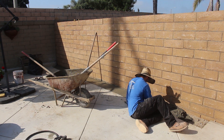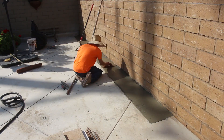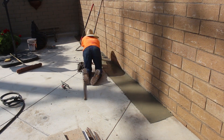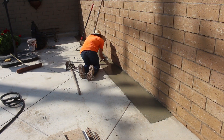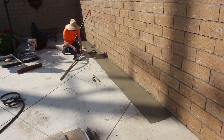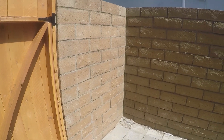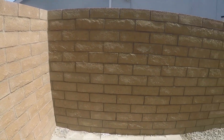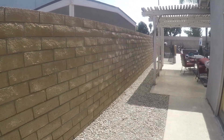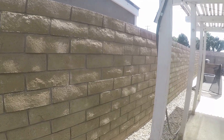There's the pool deck, and now we're going to continue through. This particular pool deck was all hand-tooled in about five-foot sections on a 45-degree angle — and boy, those joints are so crooked. That's why I like saw cutting, because you never have a crooked joint. We put the stepping stones back in, reorganized the gravel, cleaned everything up — the back wall, pool equipment.